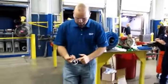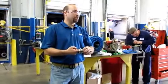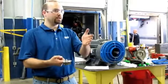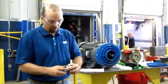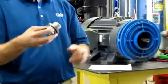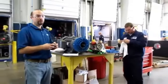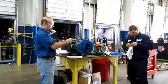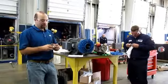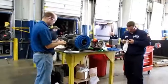The stationary seal is in the seal chamber. All sealing is happening between this carbon face and that silicon carbide non-rotating face. What happens when you dry run or deadhead a pump is you build up so much heat that you lose the lubricity between the two seal faces — no lubricity between two pieces that are almost glass. You build up a ton of friction. What's transmitting all the torque now? The bellows is transmitting all your torque — that's probably why you get a bellows rip. Plus it gets really hot really quick. I've seen stainless steel blued just from water and friction.